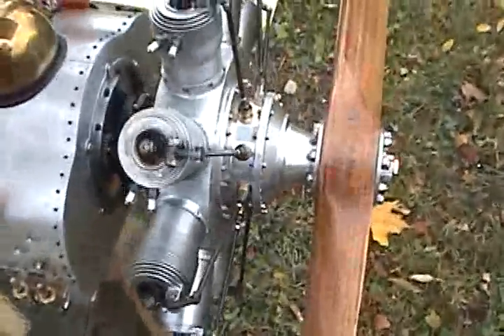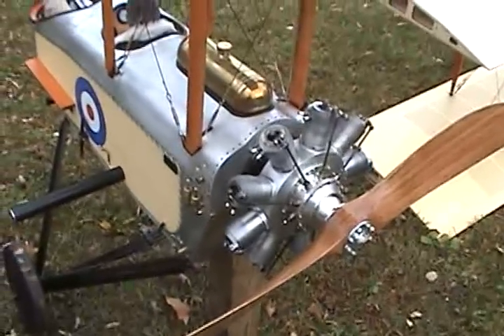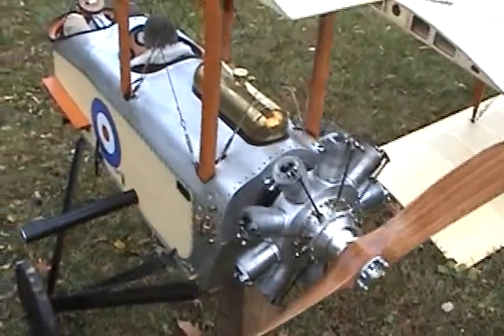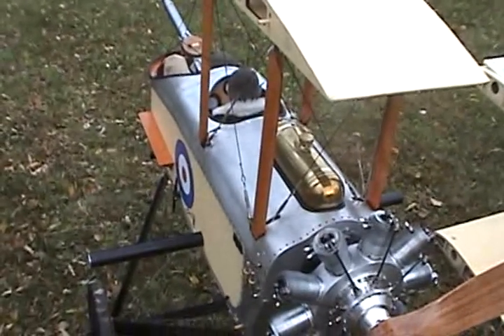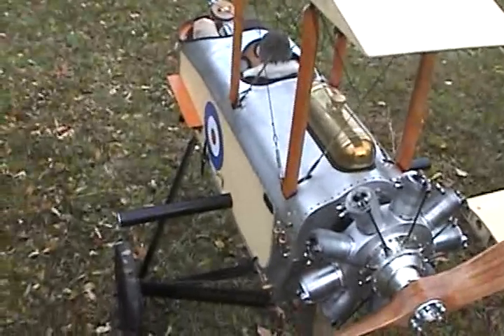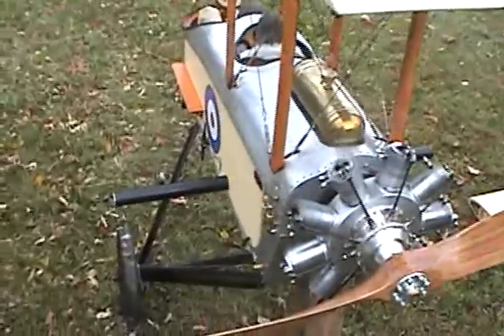This engine turns on high speed about 2800 RPM, second speed 2400, and about 1600 and about 1000 on the fourth speed. The fourth speed really is only used for coming in and windmilling, because it doesn't keep running that well on fourth — the compression is going against you. So when you're landing, the windmilling is supposed to help you keep the propeller turning, and that's how they work between third and fourth speed.